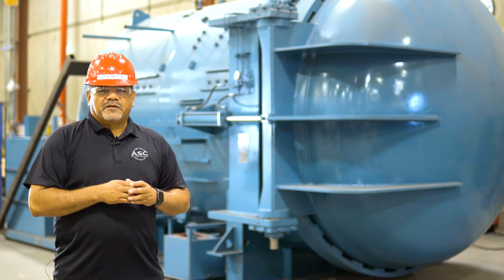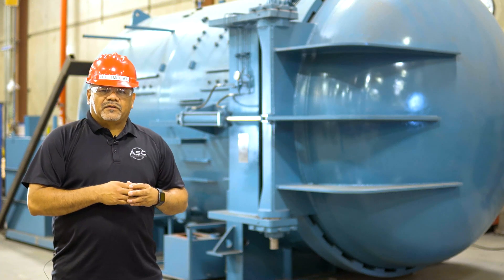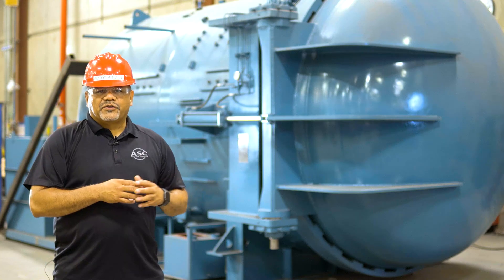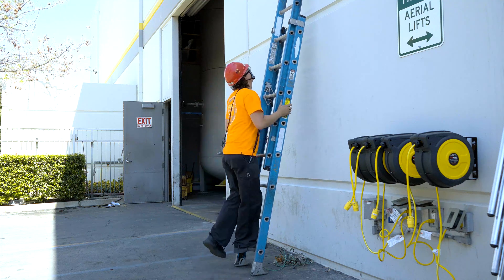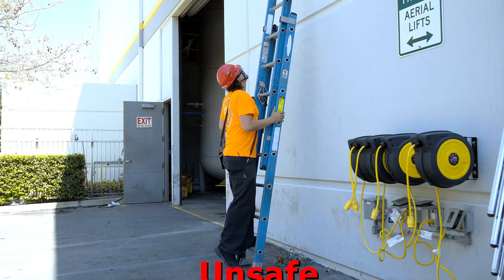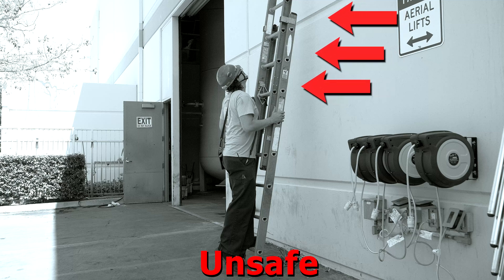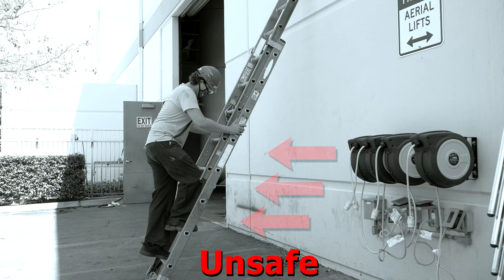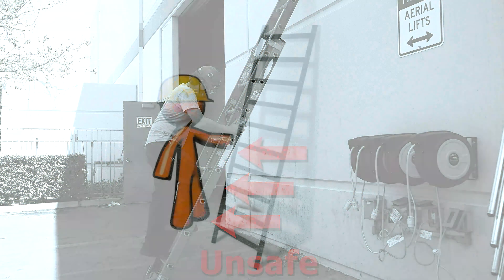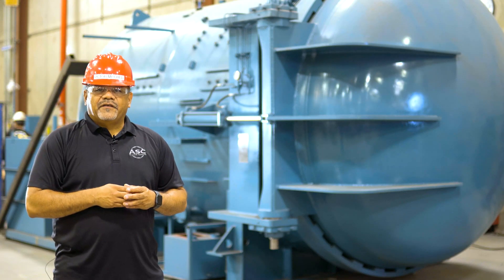Using these barricades is important not only to keep the person using the ladder from losing balance and falling from someone accidentally bumping the ladder, but also to keep people clear from underneath the ladder in case material or tools were to fall. The next consideration is pitch — the angle of the ladder between the floor and the wall. If the base of the ladder is too close to the wall, the angle is too steep, and with someone's weight at the top, a wrong movement or gust of wind can send the ladder falling backwards. If the base is too far from the structure, the angle is too flat and the feet of the ladder could slide out underneath you. Remember the 4 to 1 ratio: for every 4 feet in height, your ladder base must be 1 foot away from the wall. For example, if you place your ladder 12 feet high, its feet should be 3 feet away from the wall.